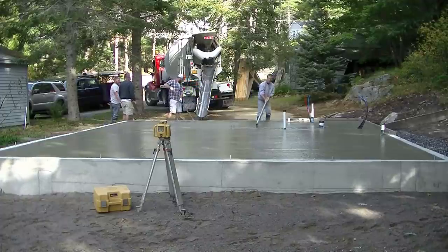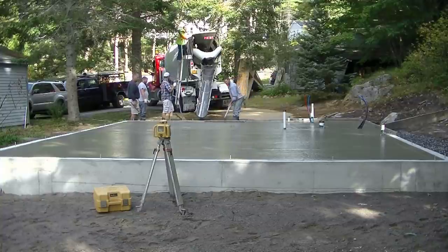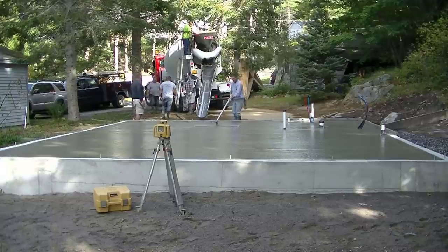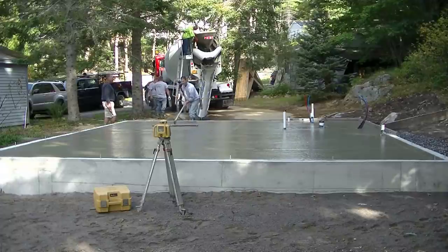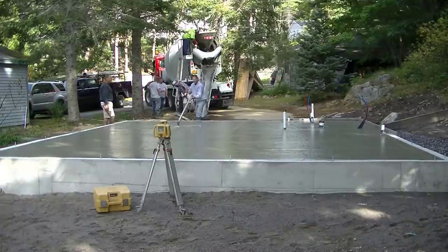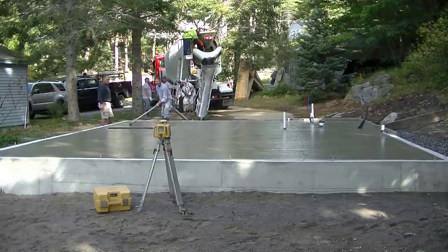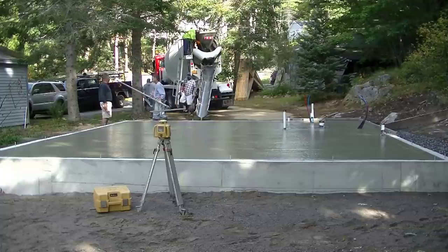You can see how I'm just following behind the screed, getting everything smoothed out. Also notice I'm in the shade today — there's a bunch of trees around and the sun's not up that high yet because it's still early in the morning. So we're not in a real big hurry getting this down, other than we want to get Luke and Darren back to that first job. The laser we use is the Topcon RL-H5B — that's the one I recommend for concrete floors. There's a link for that down in the description.